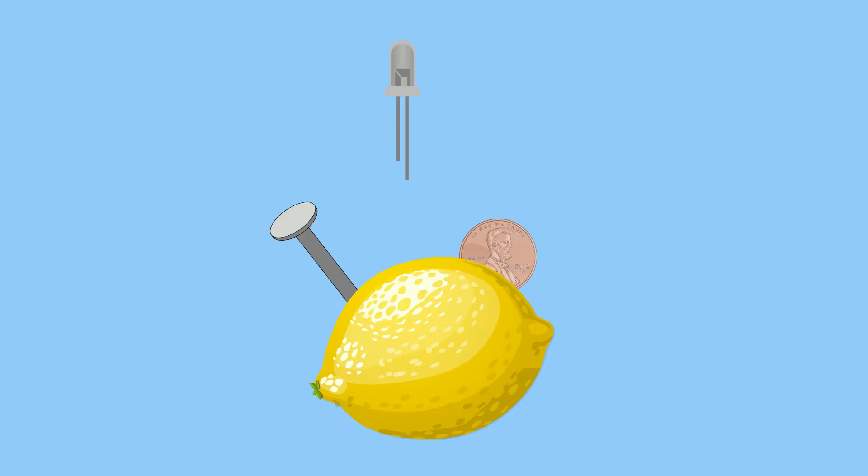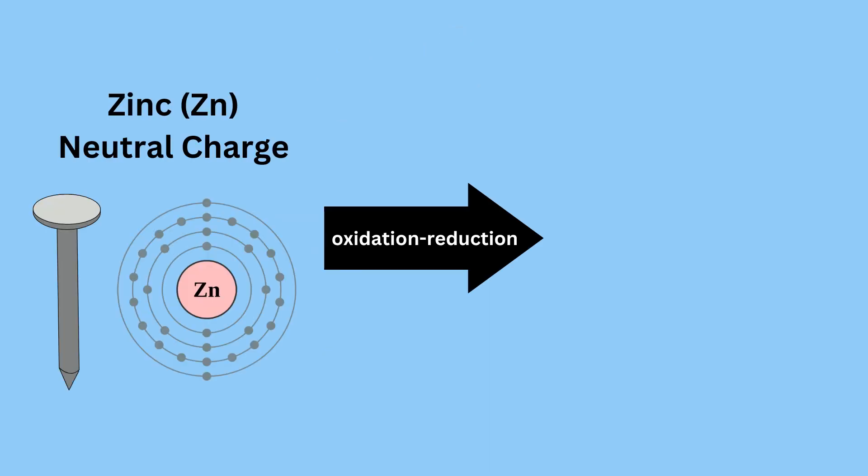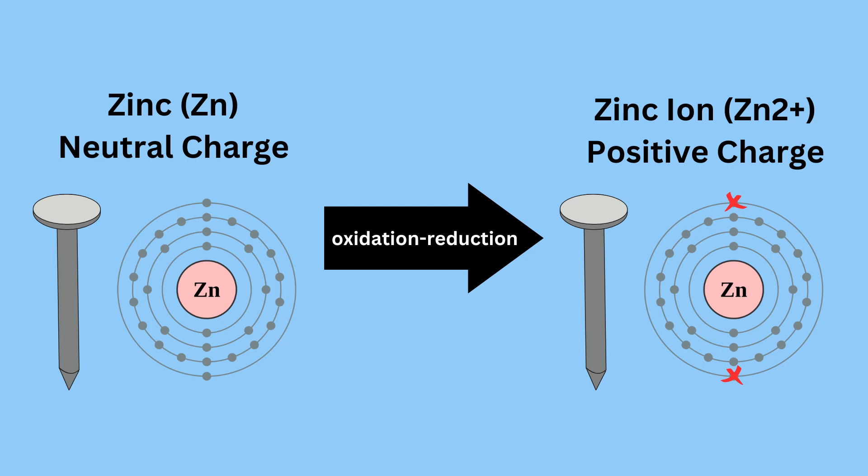In the lemon battery, the zinc acts as the source of the electrons. Zinc is element number 30, which means it has 30 electrons, and of the four shells of electrons that the zinc atom has, it has two in the outermost shell — those are called the valence electrons. When in the presence of an electrolyte, zinc will shed those two valence electrons, and they go shooting up out of the zinc, through the circuit, back into the copper, and find a happy home in the electrolyte. What were standard zinc atoms have now turned into zinc ions, which are positively charged because they lost the negatively charged electrons. Those electrons return back to the positive ions in the electrolyte, everything balances out, and all the atoms live happily ever after.